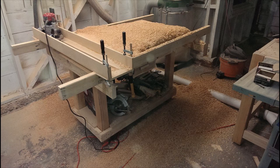And you take the biggest straight bit you got that has a nice big piece. In this case, I bought myself a 1.5 inch wide straight cutting bit, basically like a mortising bit, and just went through the whole thing. Move your router down to the lowest point on the tabletop, so that way the whole thing will be level to that lowest point. If you do everything perfectly, if you're getting those rails even, this part will be fine.